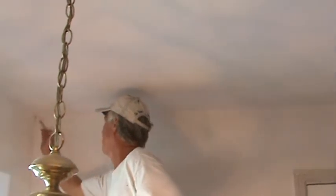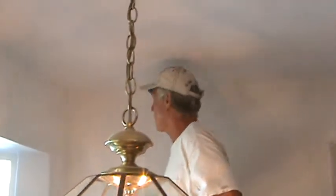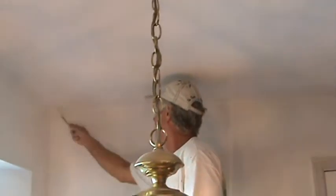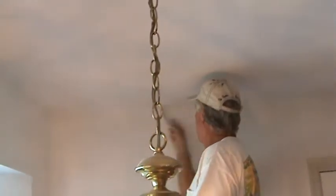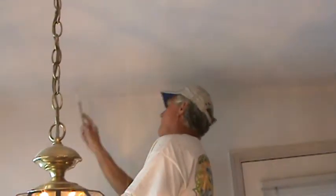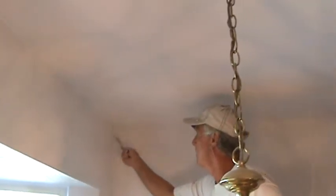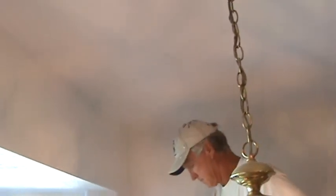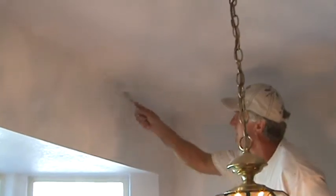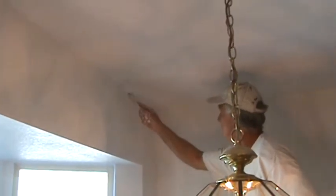Right, so the beauty of this is when you've got a wall and a ceiling to do, you always paint the ceiling first, don't you? First, exactly. Then you don't have to cut in anything right now. You're cutting it in now, even though you're doing it rough and dirty looking. Yeah, that's all you need for the ceiling, and it looks perfect, because then you're going to come back and cut in your walls. Exactly, that'll be the last step, the walls and then the cut in.